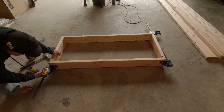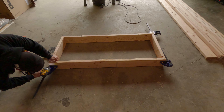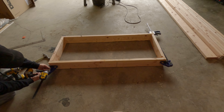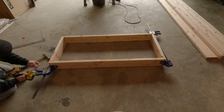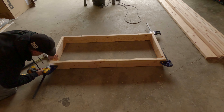I'm going through and making sure that I pre-drill all my holes. Then I'm going to run three-inch screws into this so it will be held together with three-inch screws. I've got some wood glue between the joints, but mostly it's going to be these massive screws that are going to be holding this whole thing together.